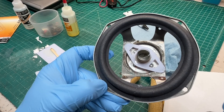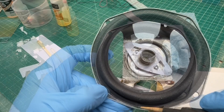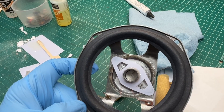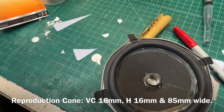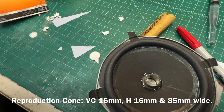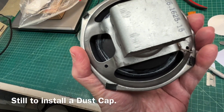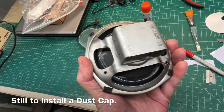As I've done in the past, just a donor surround from a larger speaker, cut down. There's my cut line, and I'm gluing it to fit the perimeter of the loudspeaker. Just letting the epoxy dry, and also where I sealed around the new cone that I built, around the surround, with tape at four locations just to hold the surround down. And sealed on the back side as well, where the surround meets the homemade cone.